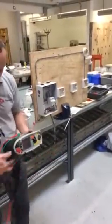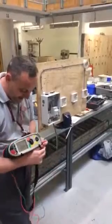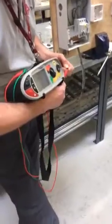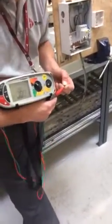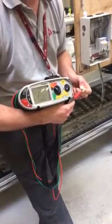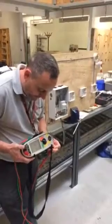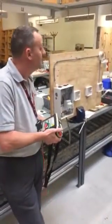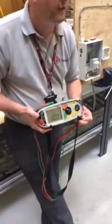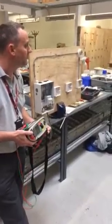Because the leads themselves are made of resistive material, we're also going to need to prove that they are in circuit and of zero value. By linking them together and holding tight I've got a flashing zero. On this instrument, flashing zero isn't zero — I need zero on its own. In order to null the leads I press the test button. I'll press it once more and I've now got zero itself. Zero flashing — no, it isn't. That means we're ready to start this test.